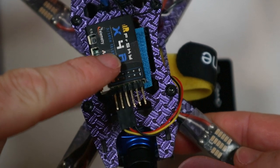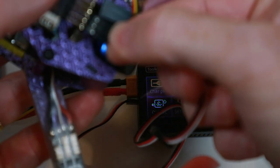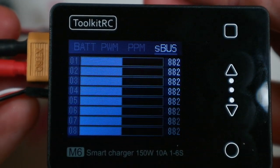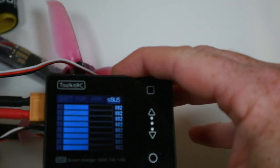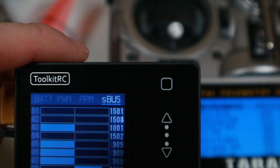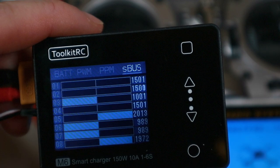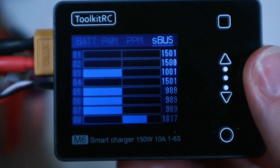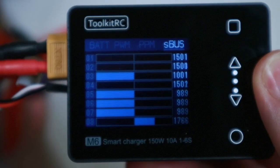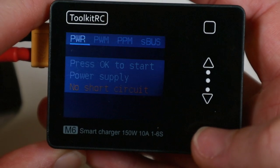What I've also got is this quad which has an X4R on it, so I'm just going to replace that little port which is the SBUS with this one. If we now go into measurer and say we want to measure SBUS, we've got nothing going on because I haven't turned on my radio. So let's turn on my radio and see if we can get something happening. Having turned on my radio here which is hooked up, I've got all my normal stick movements and mode switches - that all seems to work quite well. So while I don't think this is going to be an everyday feature, it's quite useful if you've got a receiver you're not sure is working or what modes are in it. You can test individual channels of a receiver with PWM, and if you're in PPM you can do that too.